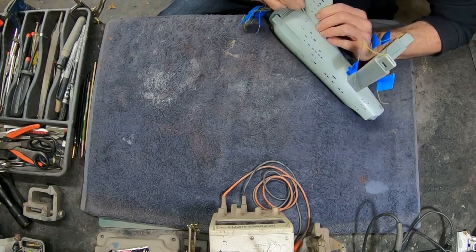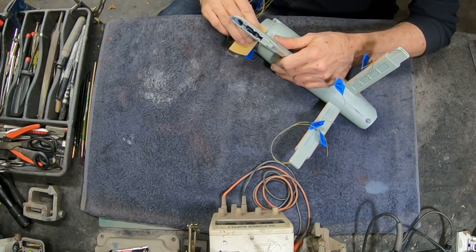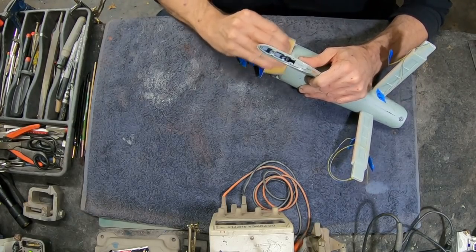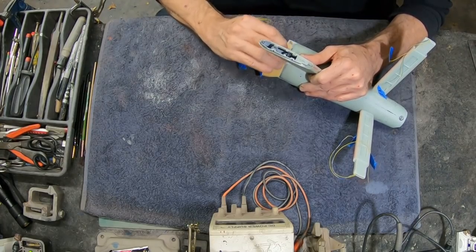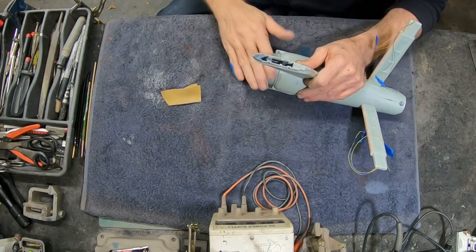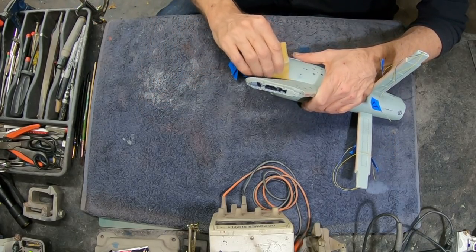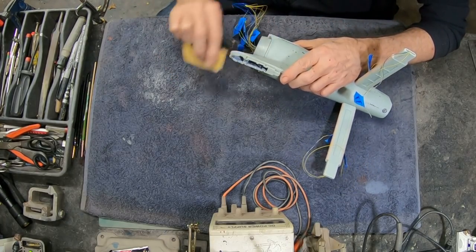Now I'm just going over that little notch right here at the front part of the deflector dish — there's one more little step down that makes. I'm not sanding this hard enough to change the shape of it much. You don't want to keep sanding until you start making a flat spot where the surface is supposed to be round. So pay attention to that.